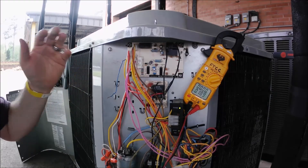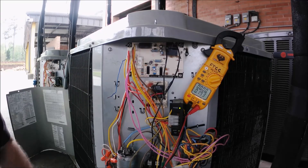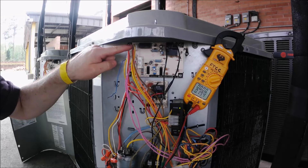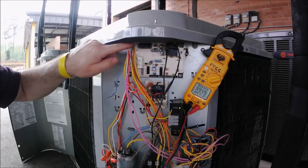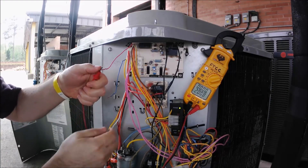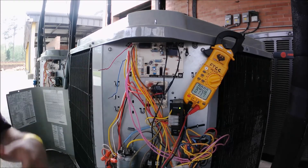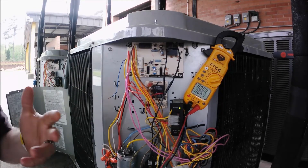You have to have power to do defrost. The next thing we're going to check is time — how do we check that compressor runtime to make sure the board is gathering it like it should? There's this T1 terminal up here in the second plug. It's on this yellow and blue striped wire right here. That wire is connected straight from the contactor and sends power back into the board on T1. We're going to check to see if this board is gathering time on T1, and it is — 25 volts.